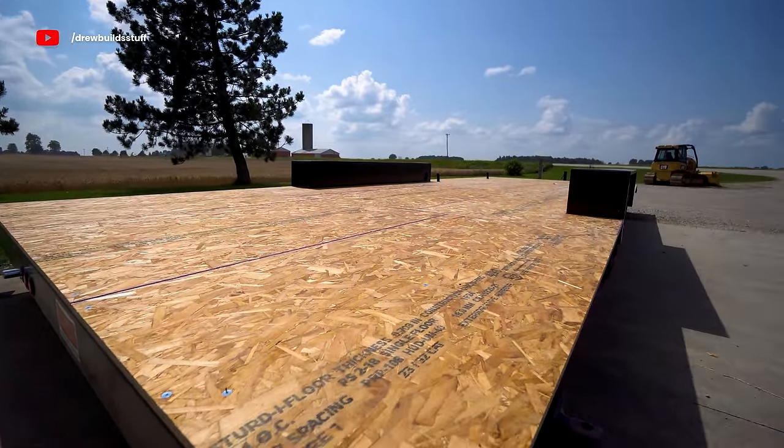To sheet the roof, I'm using that same 1/2 inch plywood, and I'm pretty much doing this in the exact same method that I did the walls. I'd use a scrap piece of 2x4 and screw it into the fascia board just so the plywood wouldn't go down any further than the edge of that board. And I nailed these sheets down to each rafter with about a 4-inch gap between nails. I also use these sheathing clips between each rafter, which gives me that 1/8-inch gap, and it also kind of binds the two pieces together and gives them a little bit more support.